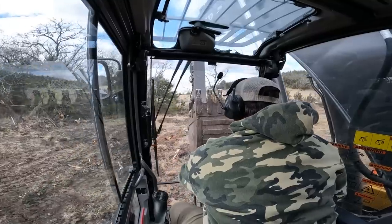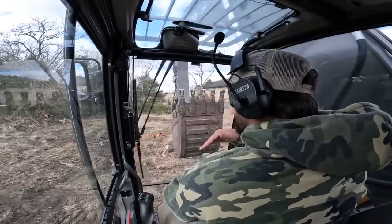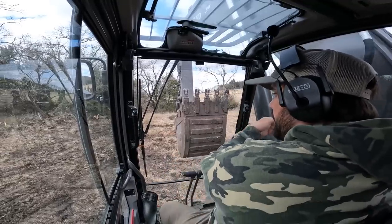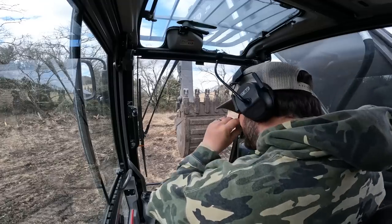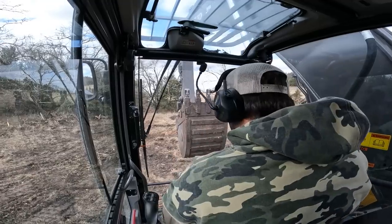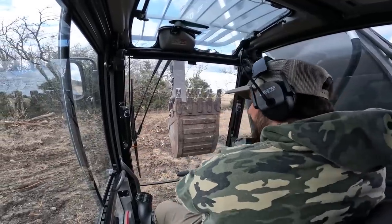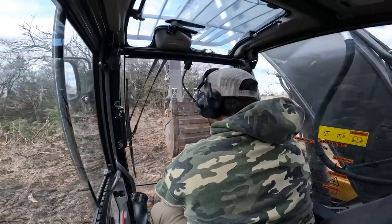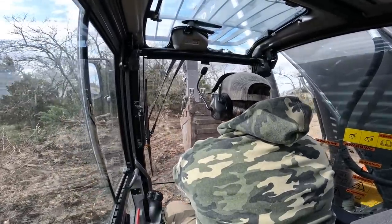I don't know if this is gonna work. What I'm gonna try to do, maybe not. I'm not gonna push it. See, ideally, if I'm sideways and I'm digging like this, I can just keep going. The problem is, if you dig a lot on the side of your tracks, you start getting a little tippy. You want to be facing the object you're pulling. For now, I'll just face it, because I'm just gonna have to basically scoot my way down. Kind of a pain. I don't know. We'll see. I just gotta get perfectly straight. Yeah, that's gonna be a pain. All right, I'll try going sideways.